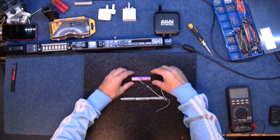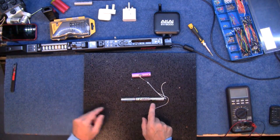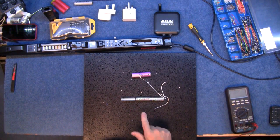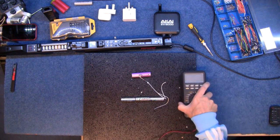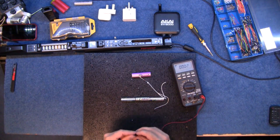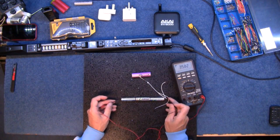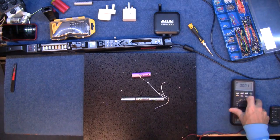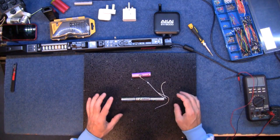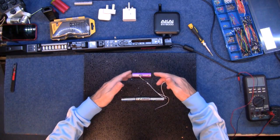There we go — a nice sparkly tile, and this is flameproof, so I can just grab it and throw the thing outside. And there are my protective glasses in case the thing explodes. I'm going to line up three rechargeable pencil batteries — rechargeables are only 1.2 volts, so three adds up to about 3.6 volts. Let me just check that — 3.5 volts, that's fine. I'm going to connect this just for a short time to this battery and hope that some of the power transfers across.